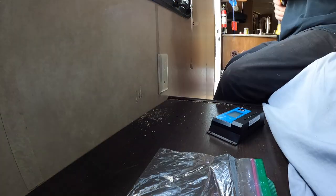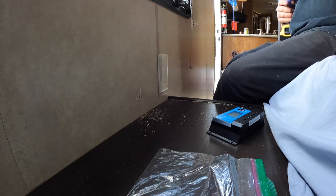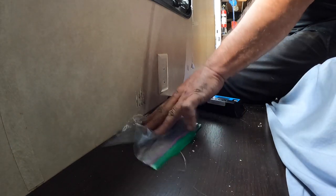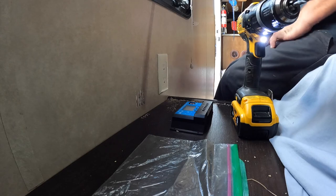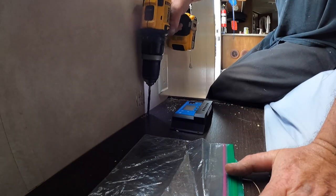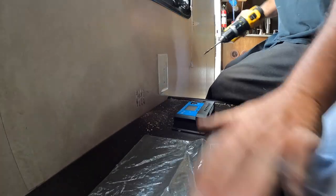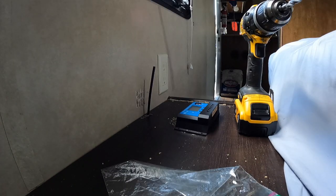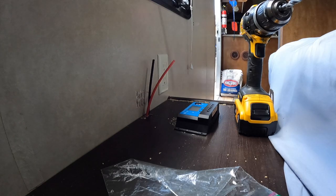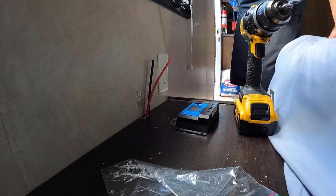I think I'm painting this trailer. The charge controller is going there, so we're okay — I can drill as much as I want right there. So now we want battery negative and positive. Let me know if that comes up. Let's try this again — negative, positive. Did I get it right the first time? Yeah, I did. So now we need solar panel negative and positive.